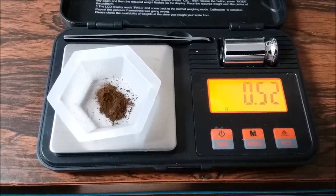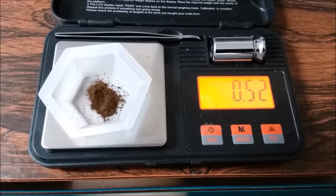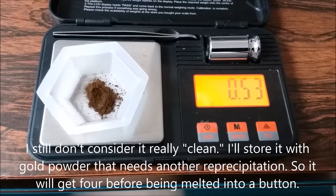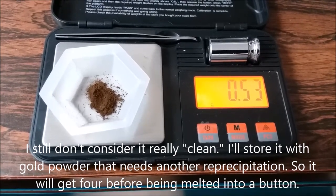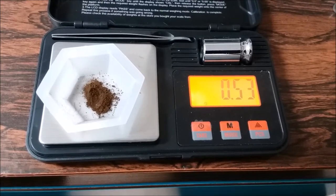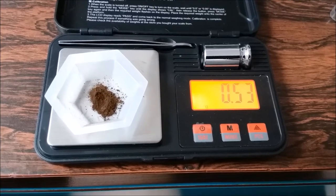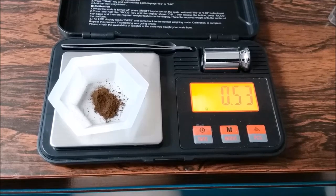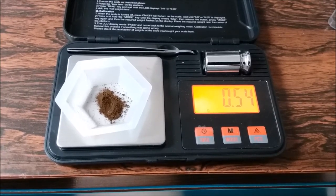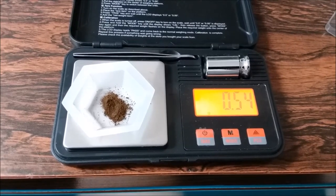There it is — a little over half a gram. I said at the beginning of this it was going to be the low-hanging fruit, starting with the easy stuff processing my filters. Turned out to be not so easy after all. Had to dissolve and precipitate this gold three times to get it clean. There was some sort of contaminant that was preventing the gold from dropping nicely and making white crystals that came out with the gold. Don't know what it was — finally got rid of it. Finally got some clean-looking gold after three drops. A little over half a gram — not as much as I'd hoped, but hey, it's free gold. Don't want to throw it away with the filters. It was a hard-fought battle — it wasn't low-hanging fruit after all, but I finally got it done. Filters processed, got some gold. Thanks for watching.